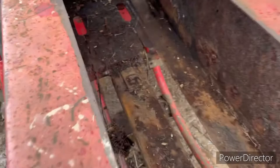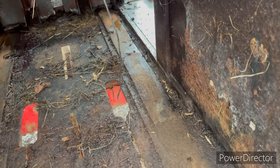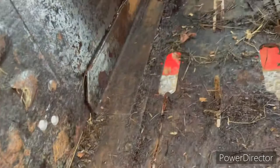Got the plunger all the way back. Now, right there, looks like there's a bit of a hump in that rail. I can see a wear line back there a ways. So I think what I'm going to do is get in there with my grinder, just buff that down, take a little bit off it. I think this side's okay. I think that's where my problem is.